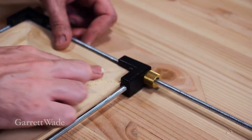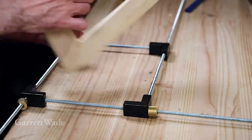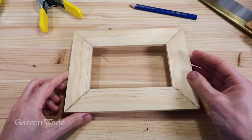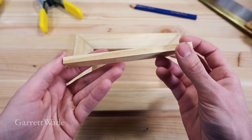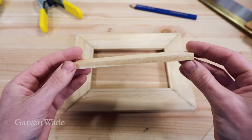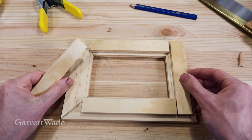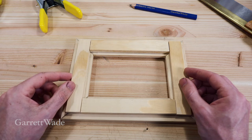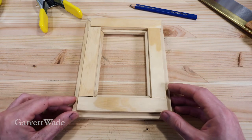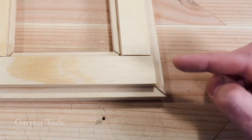Of course we're going to use the best trick in woodworking, which is to put a little sawdust in your joint. So the rails are glued together. Now we're going to flip it over and here is where we're going to do our little trick. I've cut out some thin material, 5/16ths thick — a quarter inch or 3/16ths even would work fine. I'm just going to frame that little line that we made earlier. I'm going to glue those down and that will form the recess of our frame.